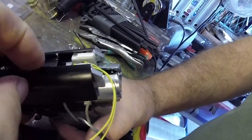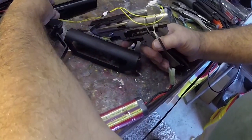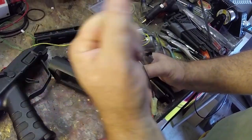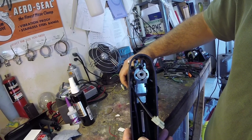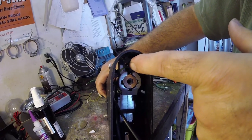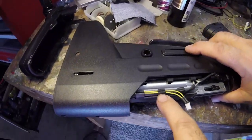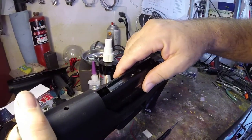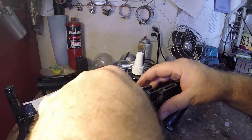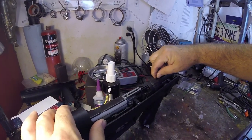We also needed to remove some of the metal here so it didn't interfere with our switch and wiring. Externally it looks the same, but we'll rig a different spring so you'll still have the function of racking the selector or racking the bolt — it just won't lock back anymore. We needed that space for the sensor. With the major UAR components assembled, I tucked the wires from the firing sensor around the corner and put a little hot glue to hold the harness in place, then routed the wires up underneath the retainers. When the simulated bolt is in position, it runs right on top of where I put the connector, so I'll add wires to extend the connector further up to keep wiring out of the way.